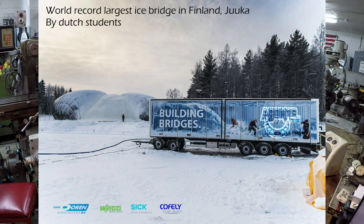There's a few things that get involved here. One, in the picture there with my logo, they use basically a giant balloon. They blow that up, and then they start spraying the ice over the top of it. And so that creates the arc there and the dome of the ice bridge. And then once it's set, they remove the balloon from underneath it.